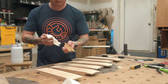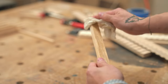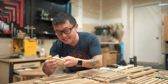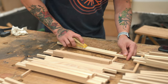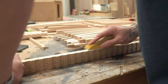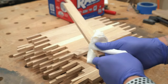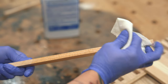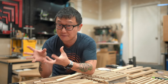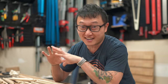Once we've gone through all the grits, we're going to take a wet rag with water to wipe down all the parts — essentially water popping them to raise the grain and reopen those pores. Once everything's dried, you can feel that the surfaces are really rough, so we're just going to hand sand everything lightly with 180 grit until everything feels smooth again. There's really no need to mark the surfaces with a pencil this time since the raised grain will be a good indicator of where it still needs sanding. And then finally, we'll use mineral spirits to thoroughly wipe down all the parts and make sure there isn't any dust left, because otherwise the finish will bond to the dust instead of the wood fibers and create a microscopic paste over our surface — which is definitely not what we want.